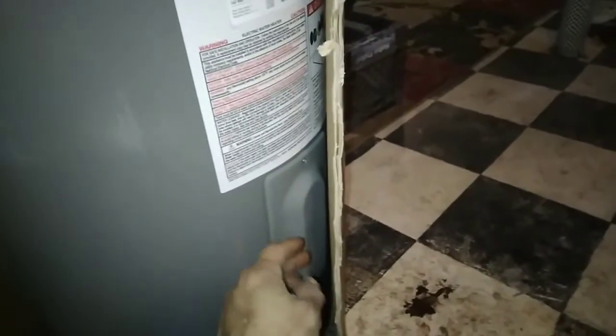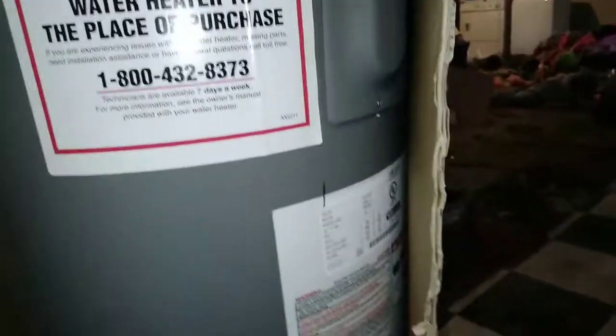In the summertime, those four 100-watt panels will be hardwired to this 600-watt DC element, and I don't want to have it at max load all day long, so I'll be running it at two-thirds of its power capacity. That'll just be on every time the sun is out. On really sunny days, or when the wind picks up and the battery starts getting real high, if the wind turbine spikes and the dump load needs to kick on, that guy will be up here. Obviously water tanks heat better from the bottom up, but the dump load will just help give us really hot water that day, I guess.